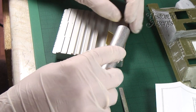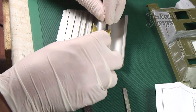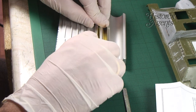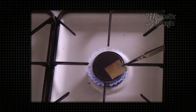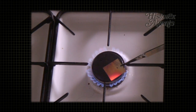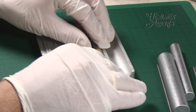Firstly, pre-form the part on the upper side of the tool. To do this, use progressively smaller sizes of roller. Also, use a slightly undersized roller in a wider channel. If the brass is too springy, you need to anneal it by heating it with a flame until red-hot. After annealing, it should now take a cylindrical shape more easily.